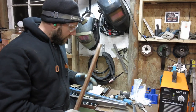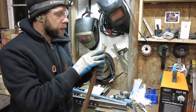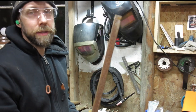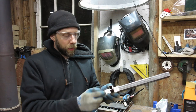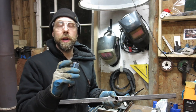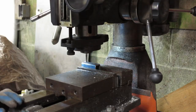What I'm going to work on now is a little tab that comes out here — it's the stick-out. I'm going to use another piece of this one inch OD, and this is a three quarter inch OD but it's thin wall. Here's what we got so far: the slider bar with a little nub that sticks out that I drilled a quarter inch hole in. We're going to take this part over to the milling machine, slot the hole back off of it, and cut two quarter inch slots in it. It's going to go on here for height adjustment and for 45s and bevels.